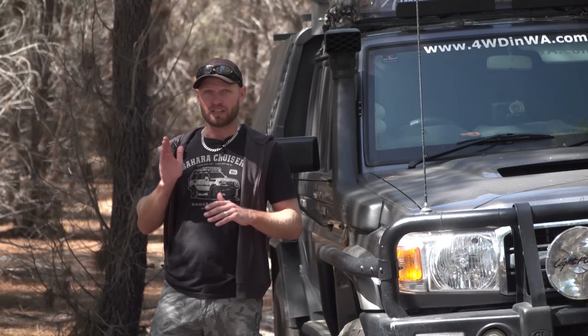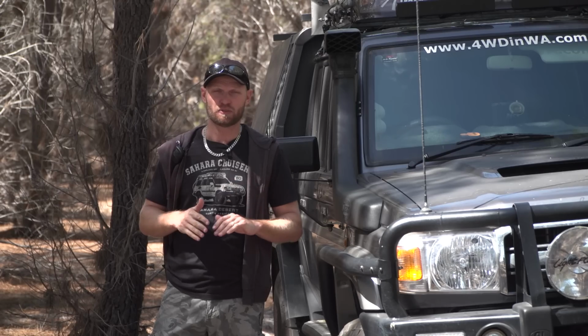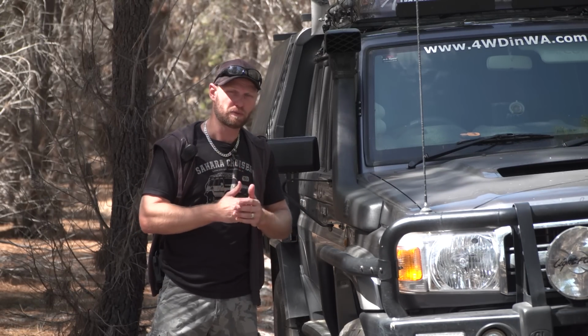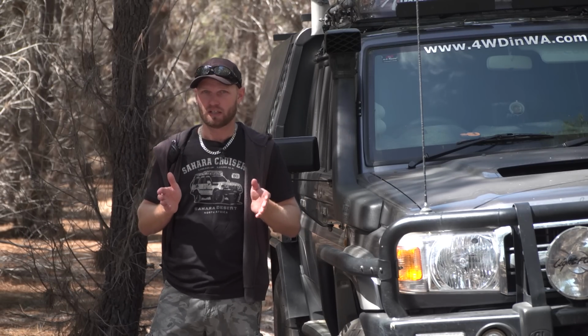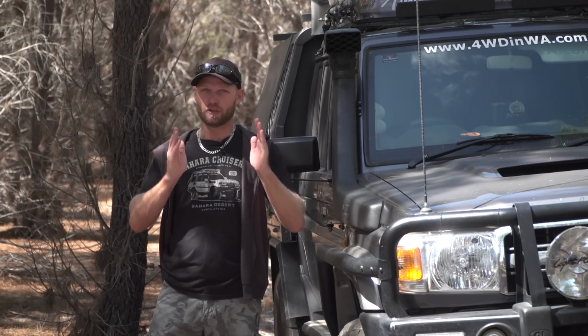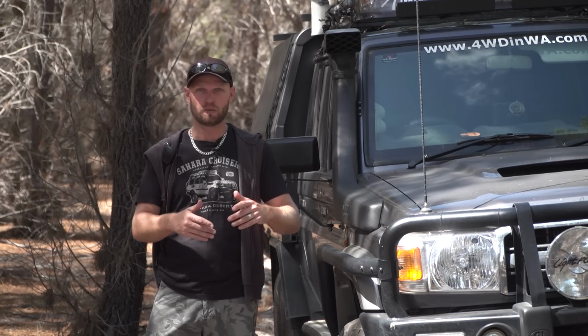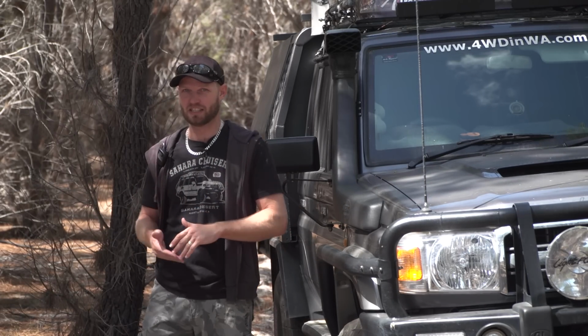40 channels versus 80 channels. Now, I'm not sure about the rest of the world, but I'm sure other countries do have 80 channels now as well. But here in Australia, on the UHF, we have 80 channels. The beauty of that is most people still use the first 40 channels. Why is that good? Well, the higher channels from 41 to 80, there's a lot less traffic.